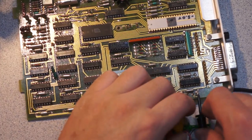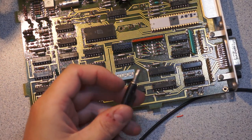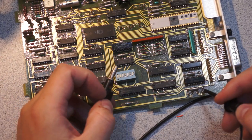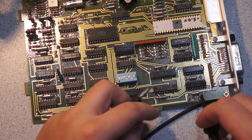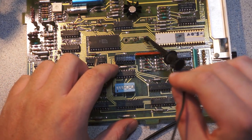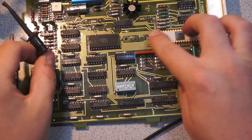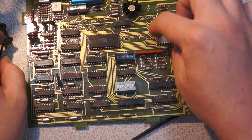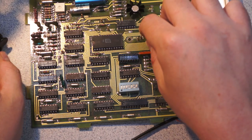Another example is if you want to measure voltages, you can get test probe leads for your digital multimeter that are a banana to a clip lead, and then you can clip on there, and that's a really solid connection that's not going to come loose. That's an area where loop probes shine, because if you put one of these on one of these vertical probes, it'll kind of stay, but I'd worry about it. These are really intended for something that plugs down on top of them. And these are actually rather unusual test points. I'm not too sure what kind of equipment these are intended for.